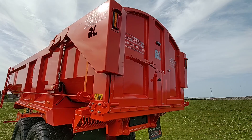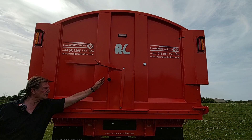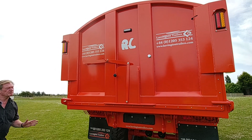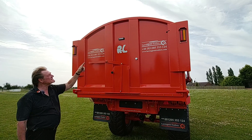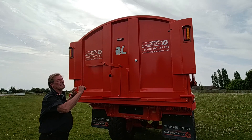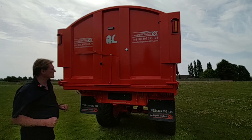On the rear of the tail door you've got your grain chute and handle, which can be positioned on the right side or the left side, with a screw so you can set it at whatever height you need. Fundamentally, the important points on the tail door are the lighting system in the top right and top left corners. We were the first manufacturer to fit lighting in these positions so that people six cars back can see which way you're turning, which has massively reduced accidents when turning right into farmyards. I believe every trailer manufacturer should now be fitting top tail door lights along with double bottom tail door lights — those motorists must be able to see where you're at.